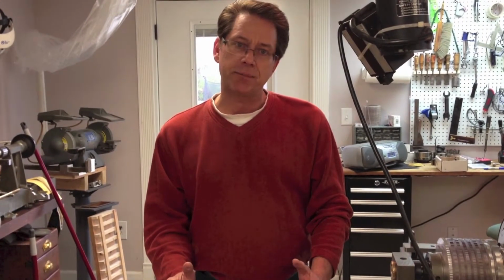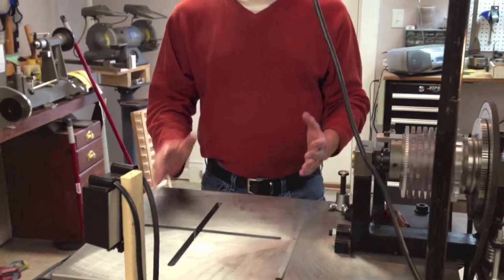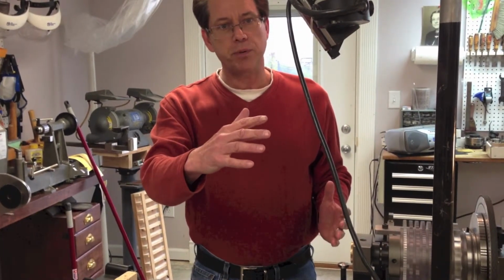We're going to talk about a split table pattern. A split table in the old days meant they'd take a nice Rose engine, either a wooden top or a cast iron top, and they'd physically cut this table in half. By cutting the table in half, it would allow them to turn very large platters on an engine turning process.